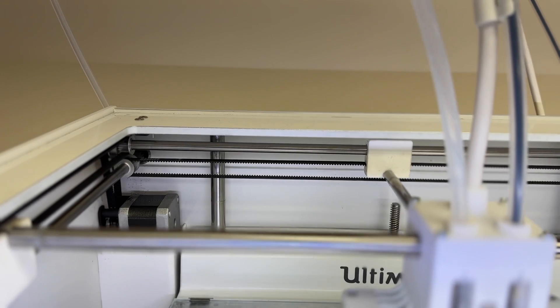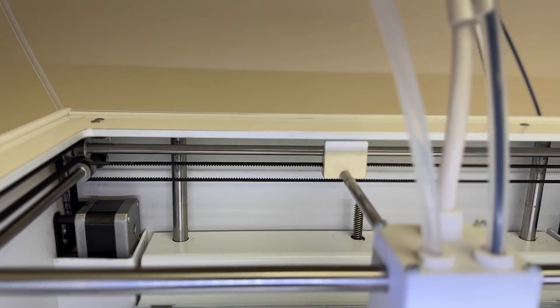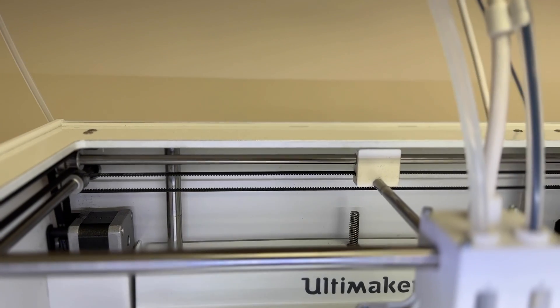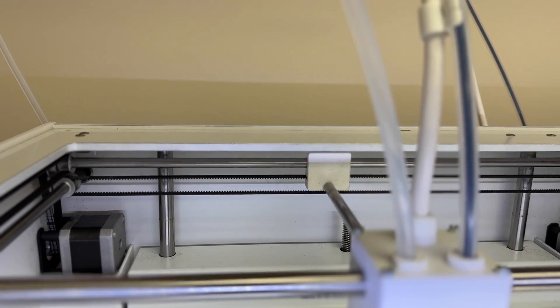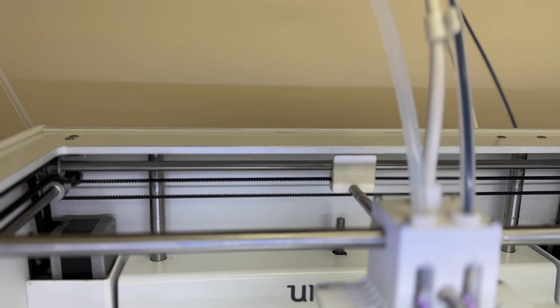It's just what I was expecting. You can hear the belts creak and crackle from across the room, and there's black dust above the motors. It's time to replace the sliding blocks and the short belts. All we'll need is our sliding block pack, short belts, and our 2mm hex head screwdriver.